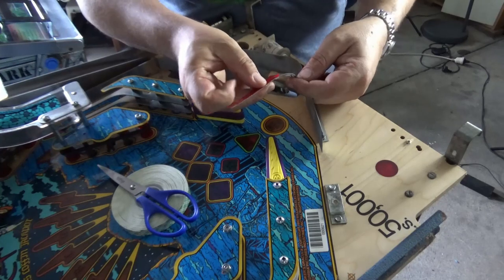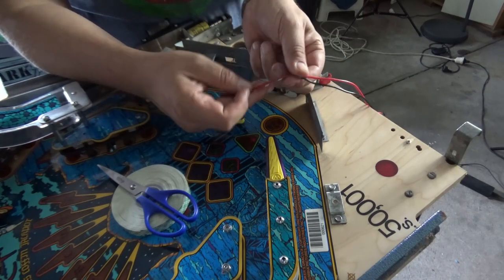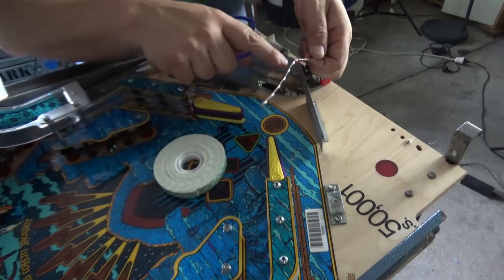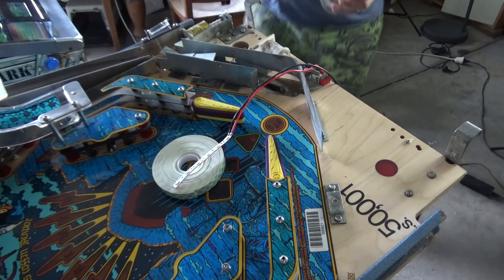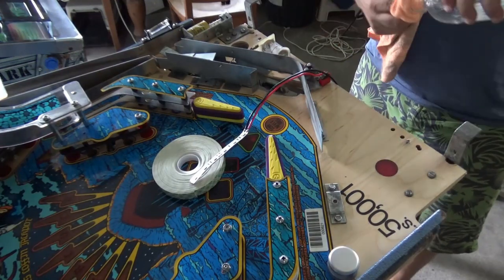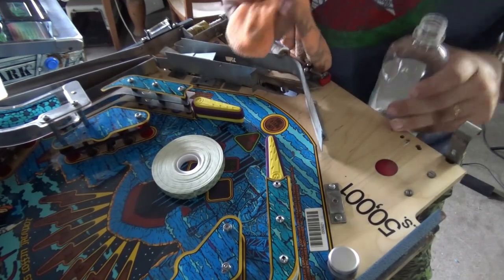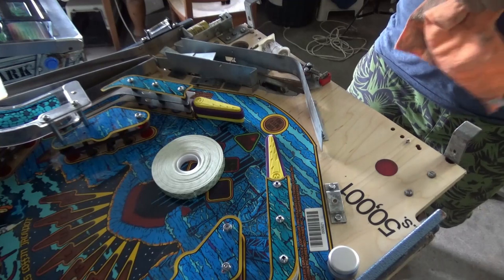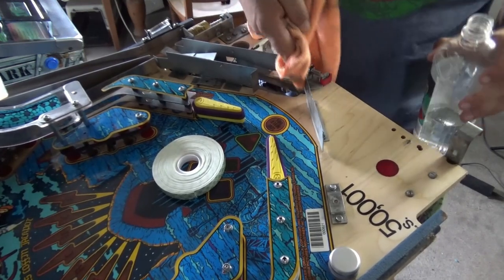The backing of this LED strip does provide some insulation. You need to check — there are two types: one has a nice insulation padding like this, and the other doesn't. If they don't have good padding, just get some 3M tape and use that. The idea is that if you're attaching it to something metal, you might get some electrical conduction and therefore a short. Before I stick this on, I'm going to get some methylated spirits — straight alcohol effectively — and wipe off any dirt from the surface where I'm going to attach it, which gives you a much better sticky surface. You may get all sorts of grime and dirt in there over the years, and a good clean means you've got a much better chance of it sticking for a long time.